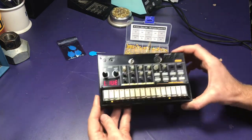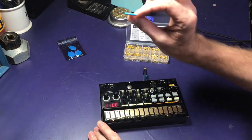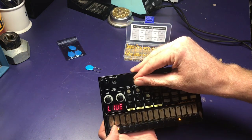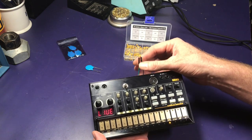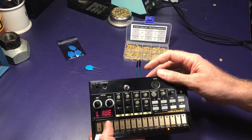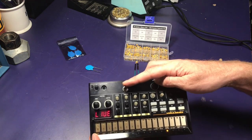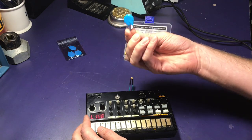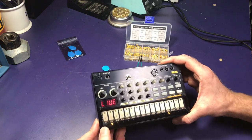I've got everything put back together and I'm pretty happy with it. Here's the snare in the center position — that's the stock snare sound. The up position engages the large 104 capacitor recommended by Darren Glenn. To me there is a difference, but not a huge difference. The down position engages the green leads, which I have a 2.2 uF, or 225 capacitor, which is much different. I much prefer that version. So I may go back in and replace this large 104 with maybe one or two steps higher — not as high as this, but higher than the 104.